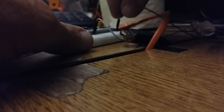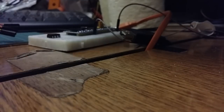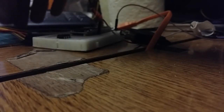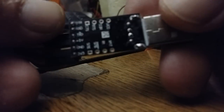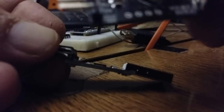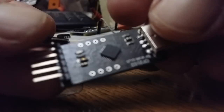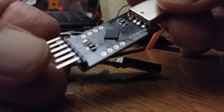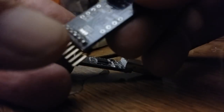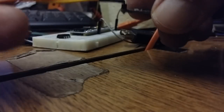So it is powered by USB. Now I will disconnect power, those two wires are to the oscilloscope. And the FTDI, I will put a link in the description where I bought this one. There are two versions. This one is better, for example, for Arduino Pro, because of the pinout. It can also work with this one, but you should put a jumper here for 3.3 volts. Remember that STM32 works on 3.3 volts.